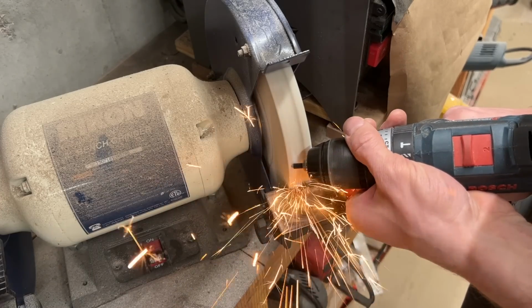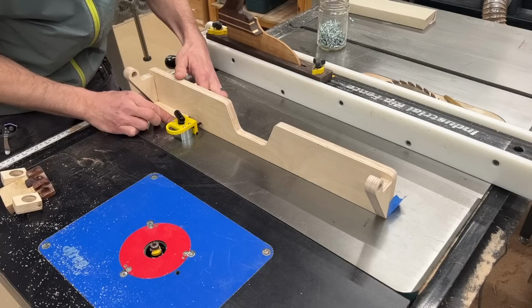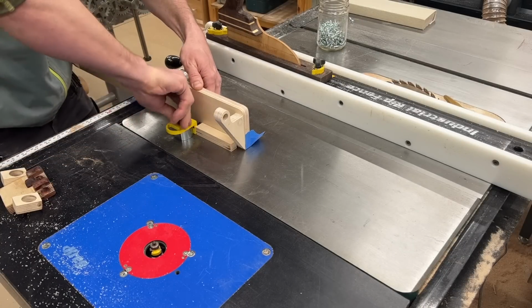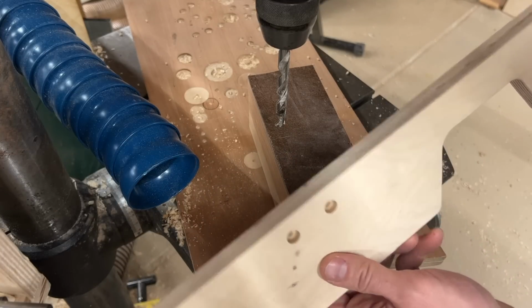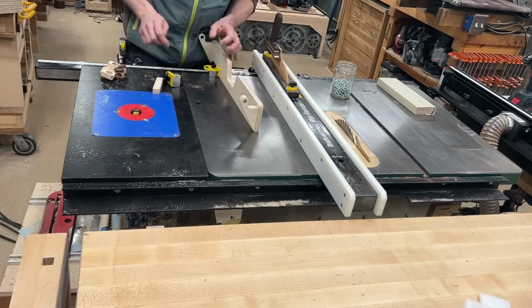The magnets do come with machine screws that thread into the tapped holes on the mounting face, and I use two of these extra screws to make locating points so that I know where to drill holes in the fence. So I use those points to drill these holes, and didn't turn the camera on. Note to the MagSwitch engineering team, maybe we should think about adding something similar in the future.